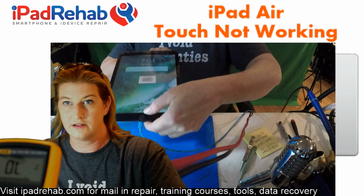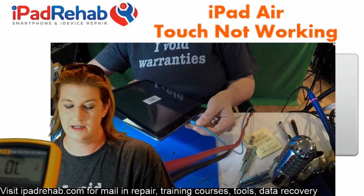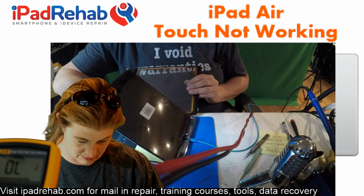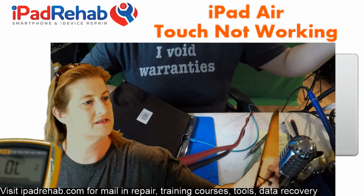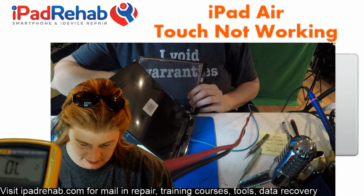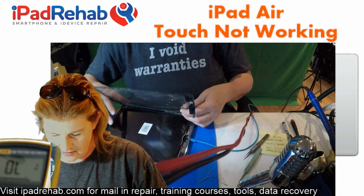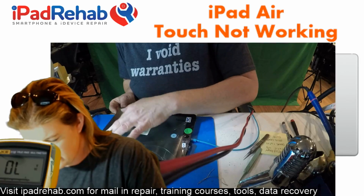All right, so there we go. That's an answer. So as long as this digitizer is good, which I would have to verify, it appears that we are supplying 1.8 V to, oh shit, the digitizer may not have been plugged in, because it just ripped out really easy. Incompetence with the general repair. Let's get one that was not last known good, October 2017. Now I can plug this one in right now because there is no power to the touch connectors. We just looked that up. We know that there are all those MT lines. Will this stay on? Does it have touch? Seems to not have touch.